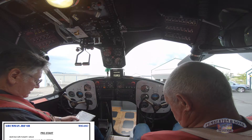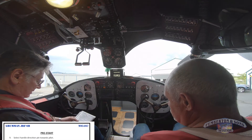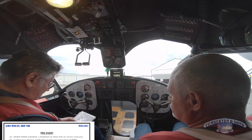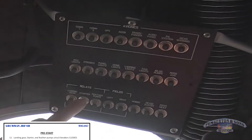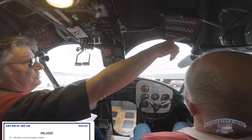We're on the flight deck. Again, pawl down, landing gear switch off — check. Select handle towards pilot, turn handle one revolution — check. Landing gear starter and feather pump circuit breakers in — one, two, three. All other circuit breakers check and they're all set.